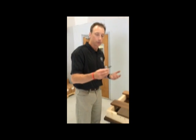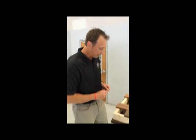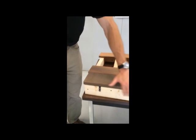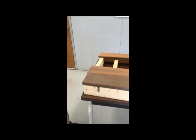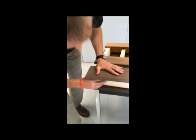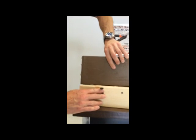At the end, there are 2 ways we can use our finish clip, basically an L bracket. On a flush fit, you want to put it against the joist and screw over top. Your fascia board will cover this up, so that's not an issue there. Also, the other way that it may be used is if you've got an overhang at the end. So we want to screw it to the joist and then screw it underneath your overhanging board, which will finish that off.